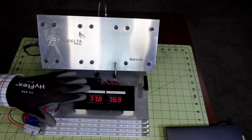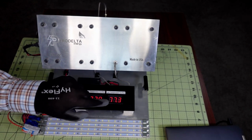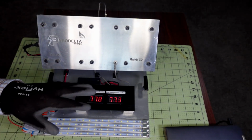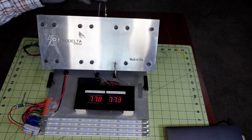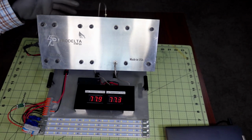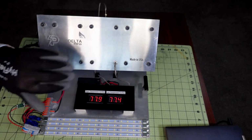We have 2 thermometers. One is attached to the front plate, and the other one is attached to the back plate. So basically, all our modules come with 2 probes, one monitoring the front plate, which is the hot plate, and the other one in the back monitoring the heat from the back. This entire module will be enclosed and submerged in fluids. So hot water and cold water will be passing, touching these surfaces.